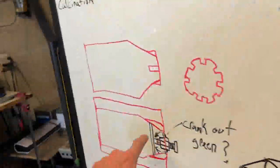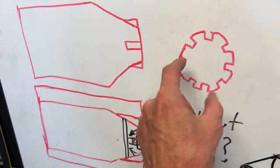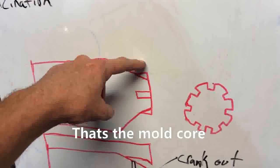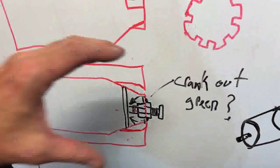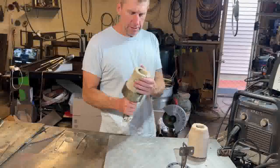Maybe we could look at that further with some smaller ones like I have on the diagram. I was thinking there's a steep velocity increase — you see this angle right here? It would look like this at every 22.5 degree position, at every quadrant for illustration purposes. This is kind of what the mold would look like on the outside. I was thinking if it had this last little lip, that would really increase the velocity right there and help the waste oil flame — to collide those last little couple particles.